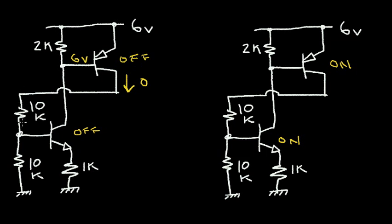Since we have no current flowing through this 10K resistor, by Ohm's law, the voltage drop across this 10K is zero. The NPN is off, so its base-emitter voltage is zero. Zero volts across 10K means no current flowing in the 10K, so we have zero volts at the base of the NPN, six volts at the base of the PNP, no collector current in the NPN, no current flowing in the emitter, and zero current in this branch.